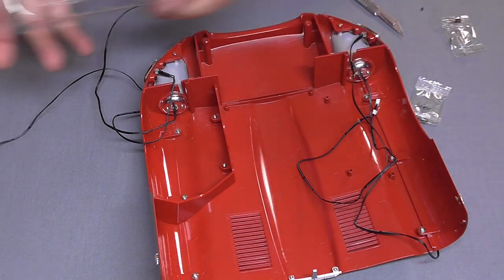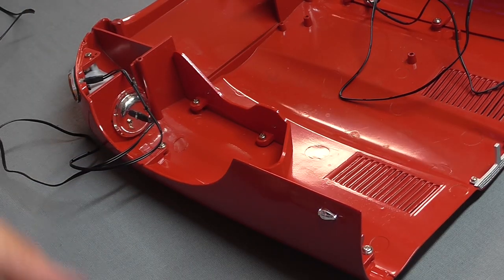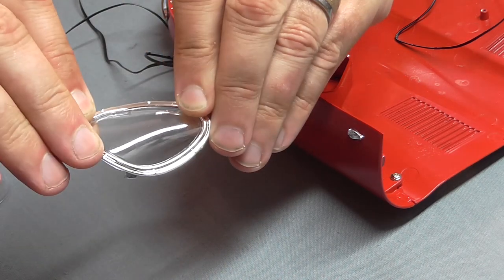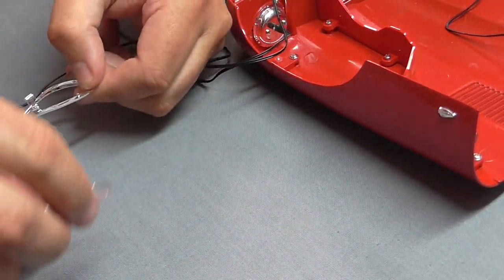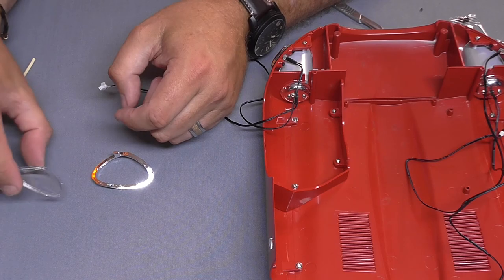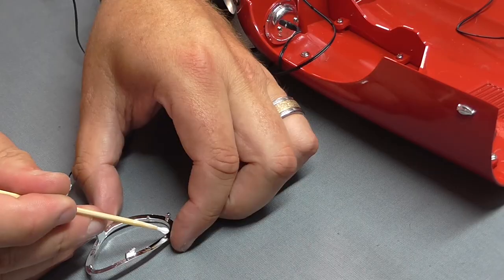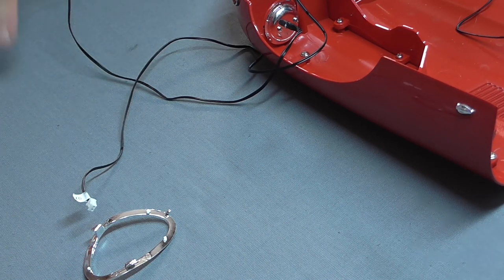Now I'm going to keep this plastic tray that the lenses are coming in. I'll pop the lens and the frame out — I don't really want to touch this because I don't want to get fingerprints on it. I'm going to need some glue and we're going to be taking the lens and putting it inside here. We need to put just a channel of glue around the outside, spot it in just around the lug holes. I'm very reluctant to use super glue on this because it will start to cloud the clear plastic. So what I'm using is a little bit of micro crystal clear — it takes a lot longer to set, but it will keep things clear and we're not going to have any smoking on that lens.